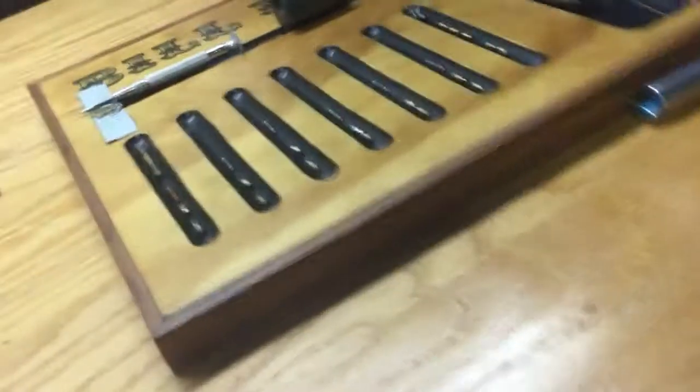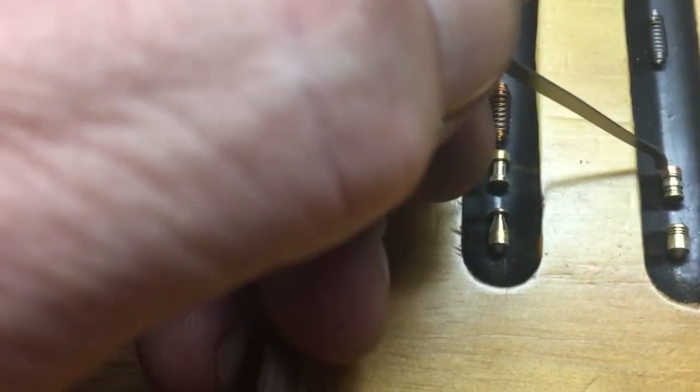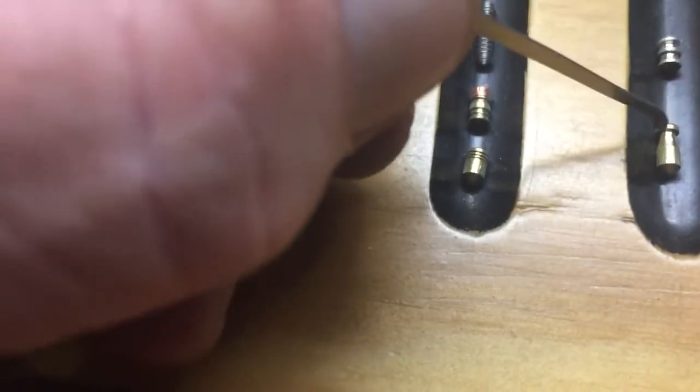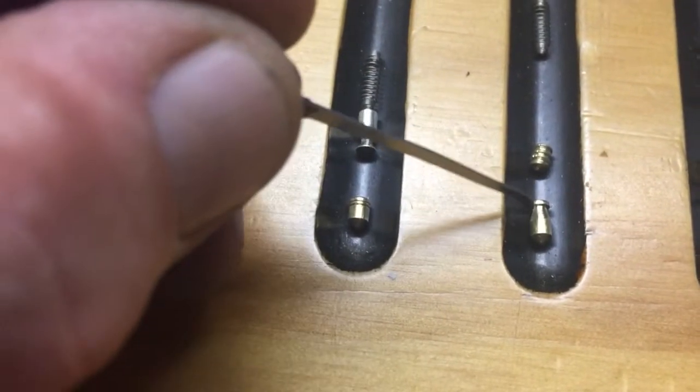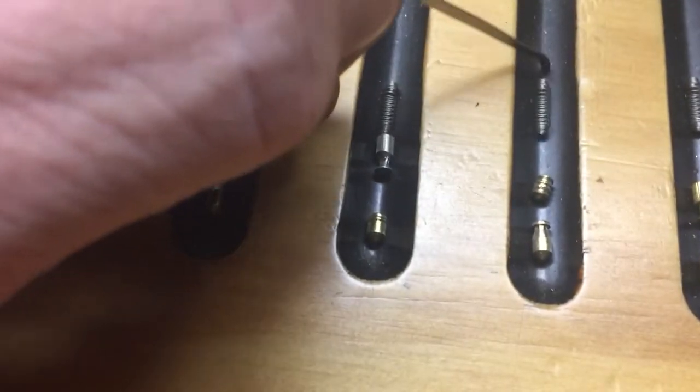Wow — nine minutes. That was a long pick then, huh guys? I didn't think it was that long. Okay, number one: this really nice bomb spool that Rookie Lock did. I did all the uppers, he did all the lowers. Very nice spool on top, number one. This really nice serrated here with another serrated underneath it. And it's a threaded chamber, so all of this is going to get caught in that chamber really bad. Another bomb spool here with this Assa-style spool up above it — serrated, real tight serrations. And then this awesome spool in four with the serrated underneath it, and that would absolutely get caught in that threading too. I believe four was threaded. We had this bomb spool in five, with this T-pin on the bottom here — that's what was holding me up. I thought it was six, but it was five that kept giving me a real deep false set and holding me up.